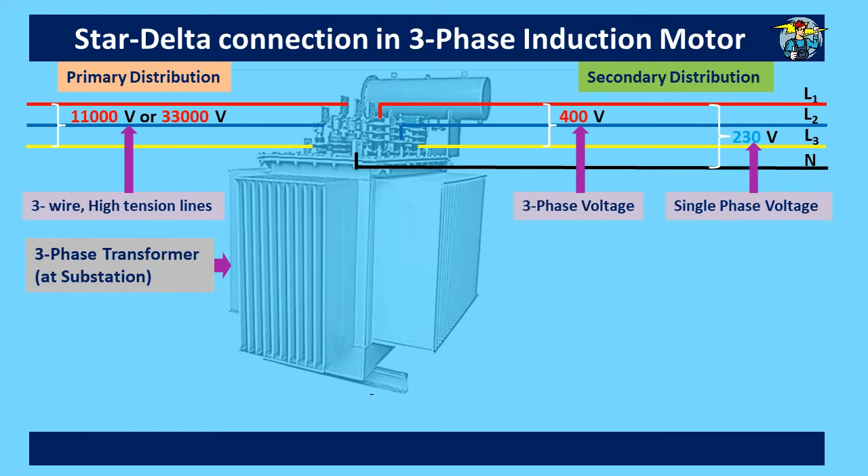This voltage is applied in the UK and Europe mostly. The secondary winding inside the transformer should be a star type to provide the neutral wire needed for three-phase unbalanced load currents. The neutral line is required for single-phase connections needed for domestic use too. It is provided by connecting the three ends of star windings in the transformer and grounding it with a neutral grounding resistor. The NGR is provided to reduce the neutral line current to a safer limit during a short circuit, thereby protecting equipment connected to the circuit.